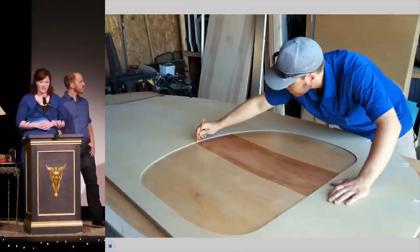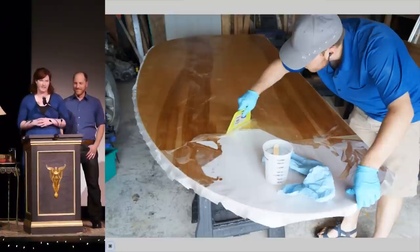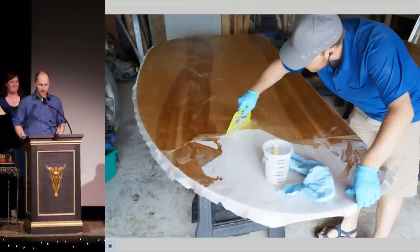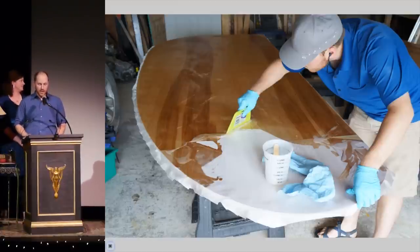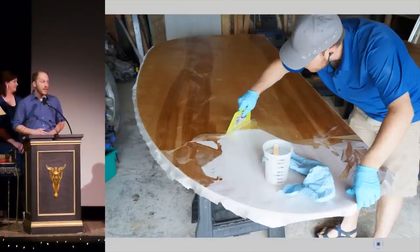Using the CAD drawing, we printed a life-size paper template. We glued it to a piece of masonite, and then used it to trace the side walls, doors, and to mark where to router the joints. Once the pieces were cut out, it was my job to sand and paint poly, sand and paint poly, sand and paint poly, and sand. To make this trailer strong and watertight, as well as show off that birch plywood, we coated the sides and top with marine-grade epoxy and fiberglass. It's the same technique you may have seen used on a wood drift boat — simply apply layers of epoxy, fiberglass, and spar varnish for days and days.